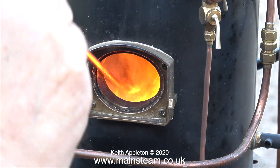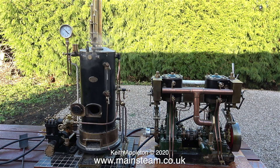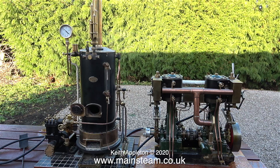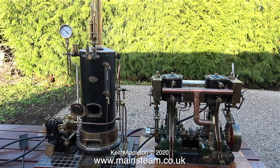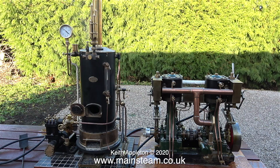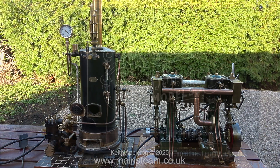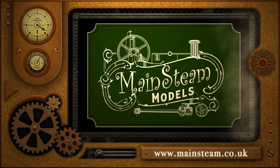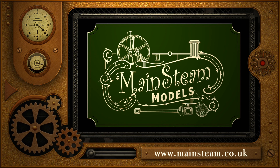I hope that this video about a quick excursion into the world of small full-size steam has been helpful and possibly answered some questions you may have been thinking about. That's it for the steam test — I'm letting the fire go out, after which I will blow down the boiler to keep it nice and clean for the next run. Dropping the pressure in this state takes a while, but the engine and pump are stationary so there's nothing taking the steam out of the boiler, and the residual heat of the fire and the copper keeps the boiler hot. I'd like to take this opportunity to wish everyone who celebrates Christmas a very merry Christmas and a happy new year — stay healthy, thanks for watching. Please take the time to visit my main steam models website, click on the section that says video playlists, and by doing that you can find other videos you may like to watch and actually watch them back to back.